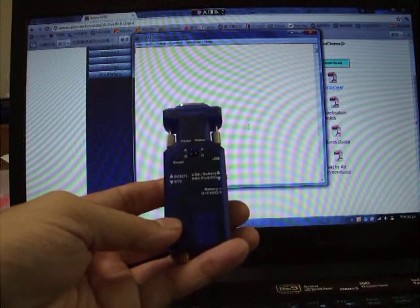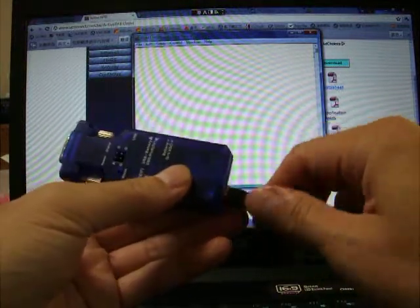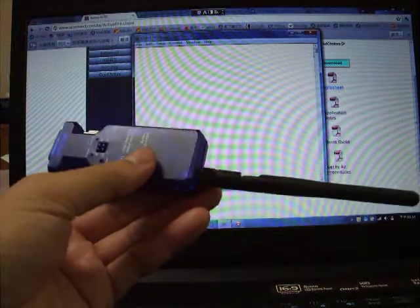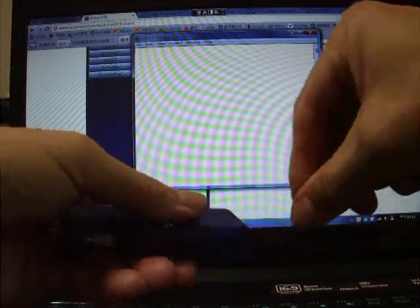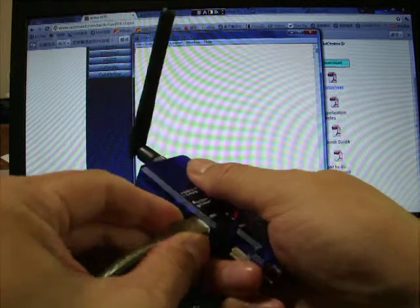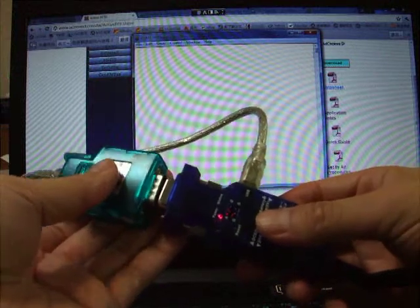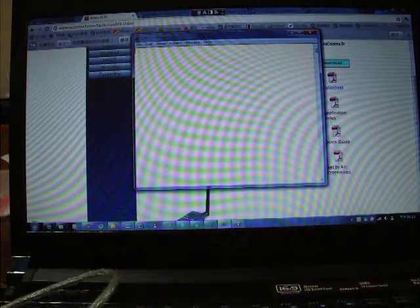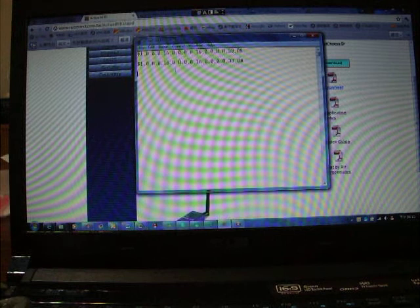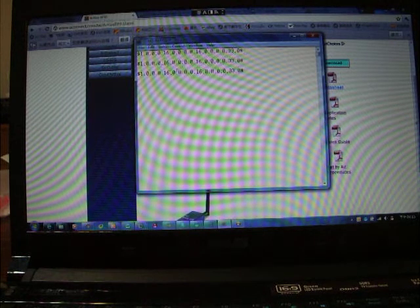The adapter will reset from here. You can plug the antenna via the SMA connector. Let's power on the adapter via the mini USB connector — the LED will turn on. We then connect the USB to serial cable, and you can see the messages from the terminal, including the reader information.